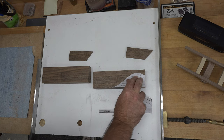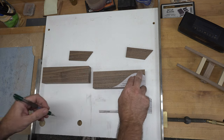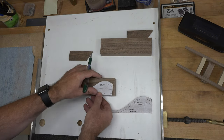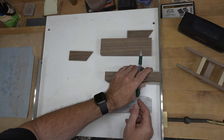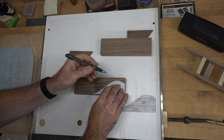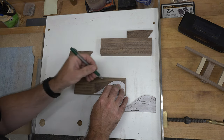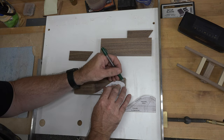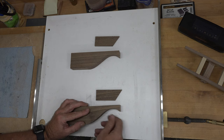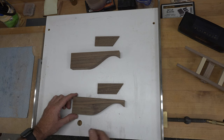It's up to you how you want to cut this — you can use a band saw, scroll saw, or cut it by hand and sand up to the line. I'm personally going to put a brand new number 7 PGT blade — precision ground tooth — into the scroll saw, as that's what I'm comfortable with. Whatever method you use is just fine. I cut it just outside the line on the scroll saw and then sand up to the line for a nice perfect cut, since the blade can deflect with thick material like this.